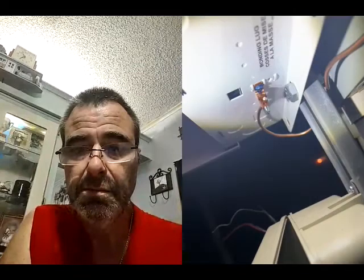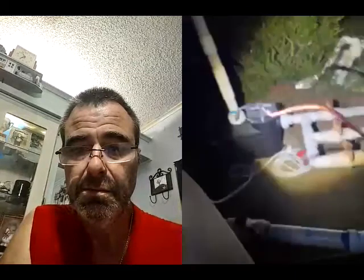This just needs power. The salt cell has a cord underneath it. You connect the salt cell to this, and I got to punch out the cord, and then there's another cord. Do you see that white cord down there? Yeah, that's connected to the salt cell, and there's a plug that goes inside the salt cell box right here. My question is about this Hayward box, since you know these better than I do: does it have to be hot all the time? I believe the screen always shows something on it, so it's a constant power.